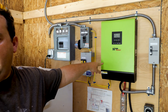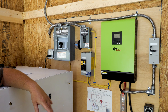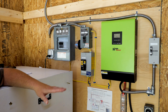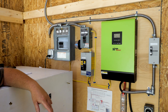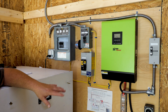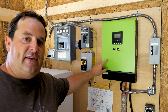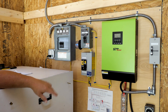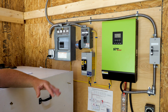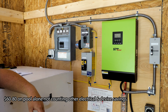We also have the MPP — this is an LV2424. It's a great little inverter at 2400 watts. It also has a solar charge controller up to 40 amps and it works perfectly, providing nice clean power. For the money — I think it was around six or seven hundred dollars — you really can't go wrong. This actually has potential to back-feed to the grid but I don't have it set up that way, so this all runs behind our meter as a way to offset energy. I estimate this saves between 60 and 80 dollars a month.